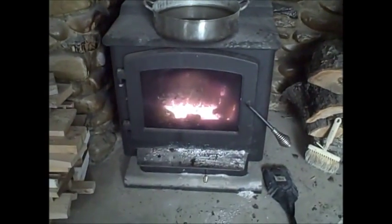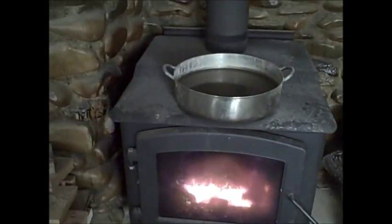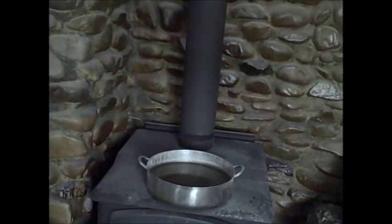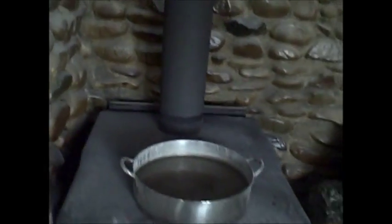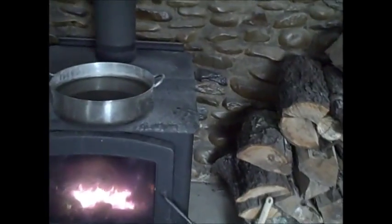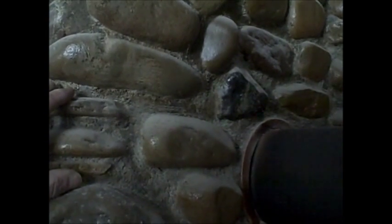And from our wood stove, but the stones that are used to line the wall and the chimney supply thermal mass to moderate the temperature inside the house, so we don't always have to have the same amount of heat being generated by the wood stove. But inside, between the cement block and these stones, are copper tubes. And when we want to gather heat from the chimney, water is circulated through the copper tubes and then back into the storage tank.